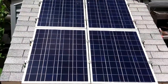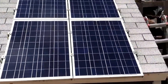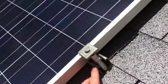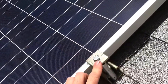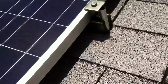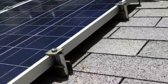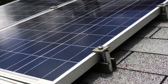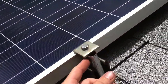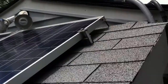I've added 400-watt UL solar panels to the back of my garden shed here. I did a different kind of mounting method that I've seen on other YouTube videos — I used Unistrut and their hardware: square washers, bolts, and it's pretty rigid. I just cut a little bit of EMT on the ends here to keep this level. I also put a ground lug on there and grounded it.